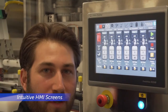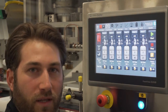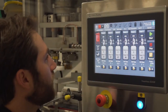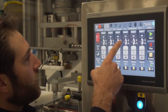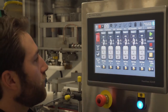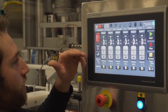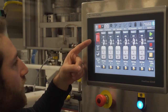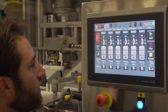Our HMI gives you the ability to control all of the parameters necessary to make sure that you are filling efficiently for each of your unique products. Here on the home screen you have the ability to individually control each fill volume for each filling head. It will show you live feedback of the actual milliliter volume in each can through our flow meters. You also have the ability to see the product supply tank PSI, start and stop the machine, and see your fill times.